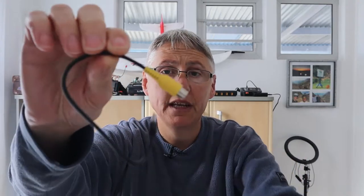With the goggles you get a charger — though I can't use this one in South Africa because it's the wrong type. You also get a video lead with a 3.5mm stereo jack, and a USB charging cable with a proprietary connector. It does not come with an XT30 or XT60 lead, but it can be charged from 5V to 18V, so you could use a 2S or 4S LiPo battery — you would just need to make that lead up yourself.